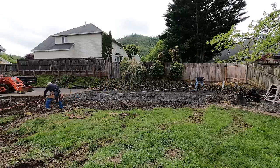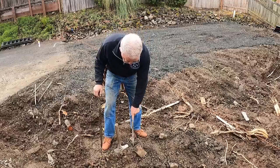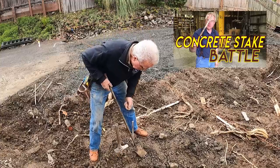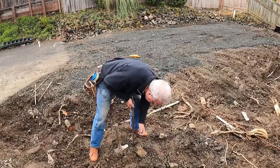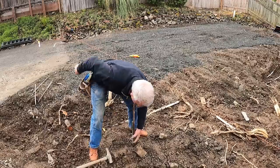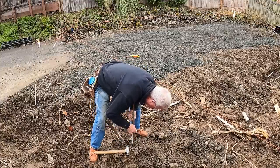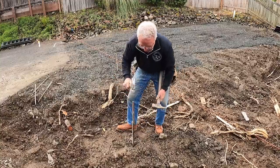So we're just doing some rough building situation - I hesitate to even call it layout, it's just kind of a close-counts moment. But this stake is too short - it's down in this soft fill, it hasn't been compacted. We've got a muddy mess here and I need it to be up. But since I'm using square stakes, this is no challenge at all. I take another square stake and run it down here until it makes contact, find a hole that's not been blocked by concrete, and tap it down until I can nail my two concrete stakes together. And then hopefully there'll be another one lining up right there. There is - almost. Try that with a round stake.